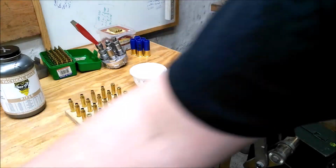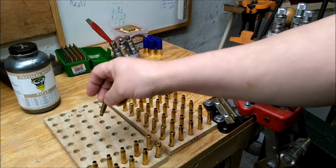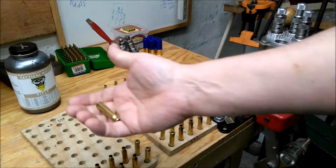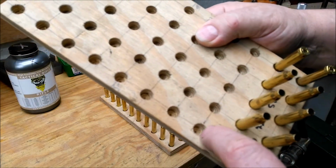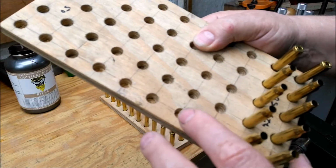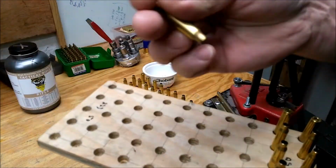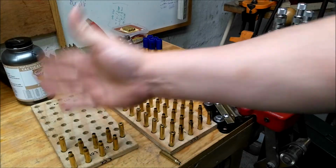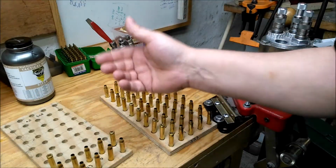Well, case in point here. Like if you flip them over, see, you can tell where you left off. They flop around. Not optimal. So what I did was I took a 1/4 inch bit, and since I'm using Forstner bits and there's a little pilot hole in there, I can use that to pretty much center things up. Drill a little bit in there, just fit the neck in. Yeah, it's not going anywhere. I mean, that fell out. That fell out first. Huge difference.